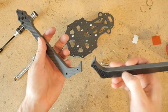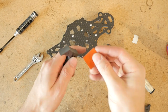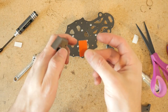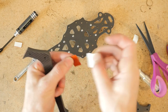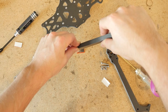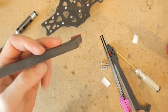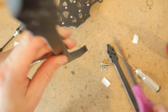Next, we're going to install a couple arms onto the top plate. First, we need to apply some silicone damping sheet to one of the arms. You only need one damping pad per pair of arms. So cut out an approximate size to cover this flat spot on the arm, then peel off the backing and stick that right on there. Use the table to apply that adhesive and make sure it's in full contact with the arm. Take some scissors to trim off the excess. My scissors are non-stick, coated with teflon, which makes cutting sticky stuff like this really easy.